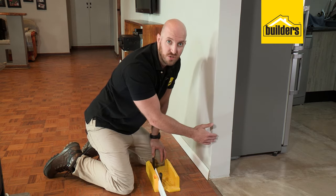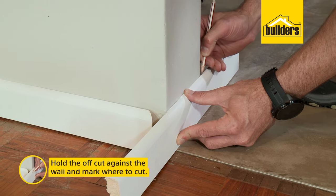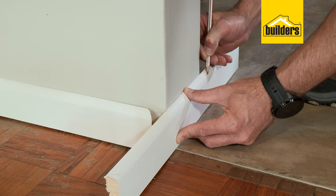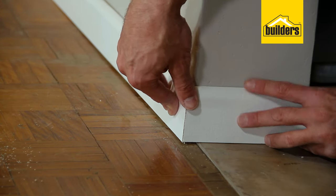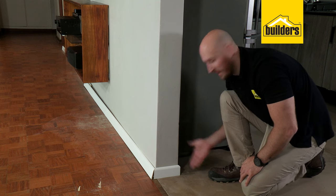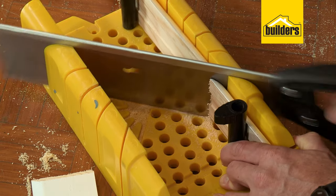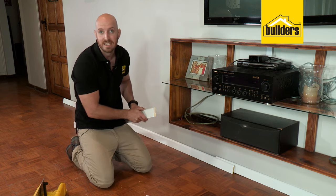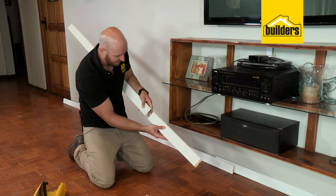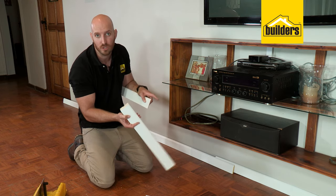Next we need to mark up the next two cuts. We'll use our off-cut, hold it against the side, and mark it up exactly the same way — hold it against the wall, mark off the sides of the wall, mark the direction of the mitre, and cut them. Those two mitre cuts meet perfectly and take shape nicely. Then do the exact same on the other side: mark the back edge, line and direction of the mitre, and make the cut. When it comes to joining up the two pieces, the best way is by cutting a 45-degree angle in each piece in the same direction. That allows them to butt up nicely together, covering any imperfections and also giving you a bigger surface area to glue them.